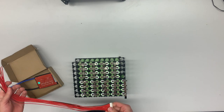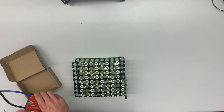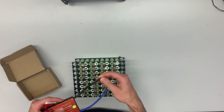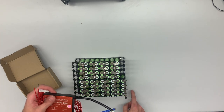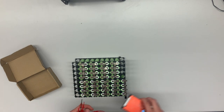one of those wires to every one of our 17 stages and then connect the blue wire to the common negative, and this power minus will then be our connection to the card. So this will be the power minus, and the battery plus will also be the power plus. All right, let's get to wiring.